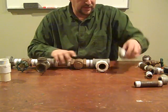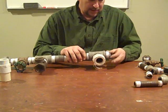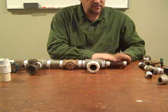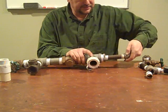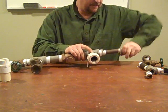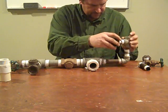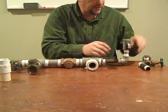I'll put the bladder on last because it's easier to build that way. After the valves, I want to reduce down to half the diameter. They don't make pipe half of inch and a quarter, so I went with three-quarter — just go with standard stuff. Your drive pipe is twice the size of your delivery; your delivery is half the size of your drive. I like to let the ram stand on its own, so I put an elbow in. The pump will actually stand on its own, which makes it nice when you're working on them, especially installing. I'm installing a little pressure gauge here — it tells me what the ram is capable of doing before I even install a delivery line.